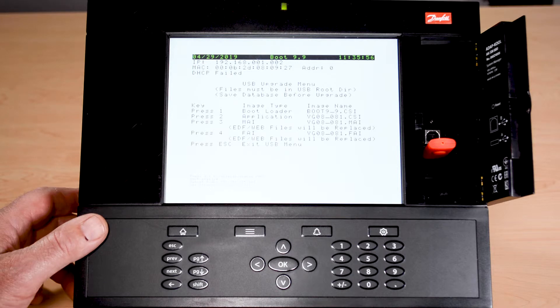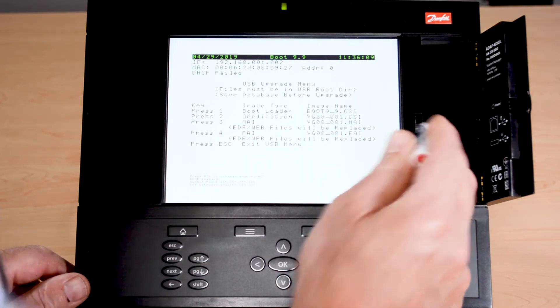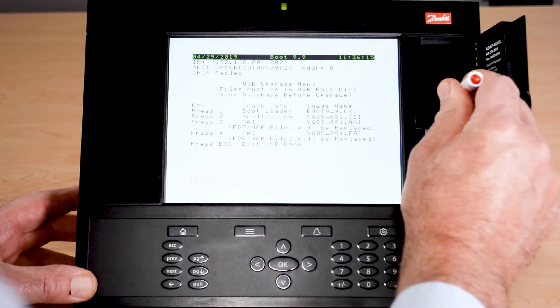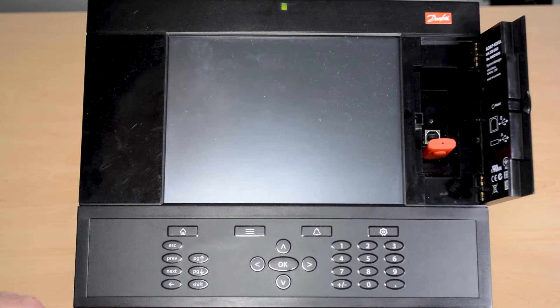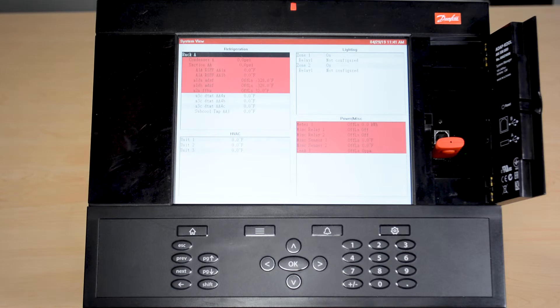When we are all done with our upgrade, we do have to boot up the control and come out of this boot mode. I will take some object that fits in the reset hole located inside the panel here, and if I hold that for about four seconds, you're going to see it will reboot the control. It will come up in normal operating mode so we can go back into normal operation. We just went through loading the program using the bootloader function via this USB through the bootloader.